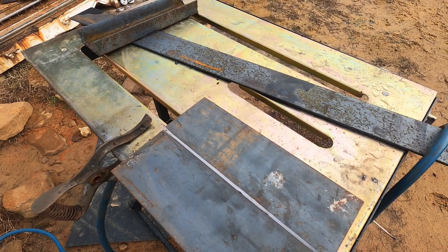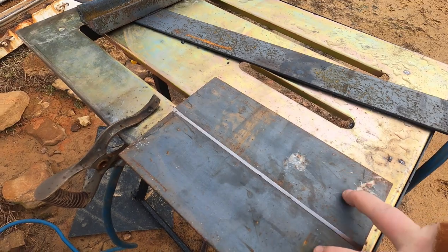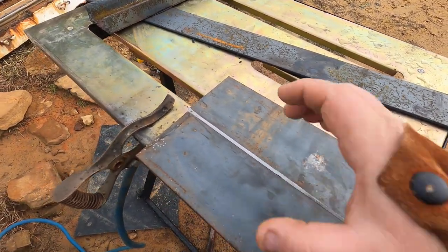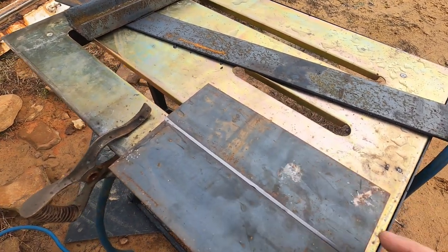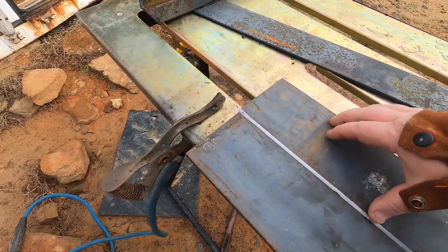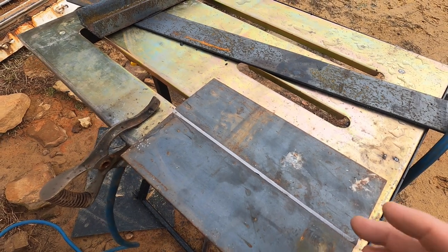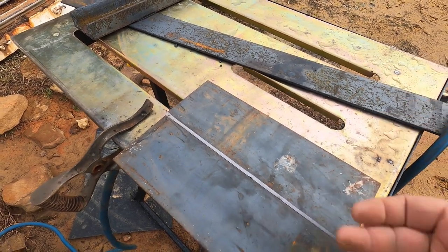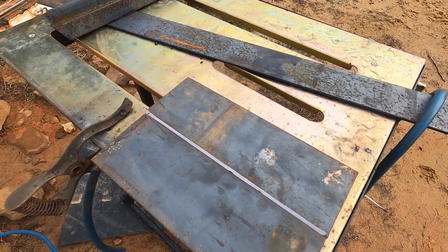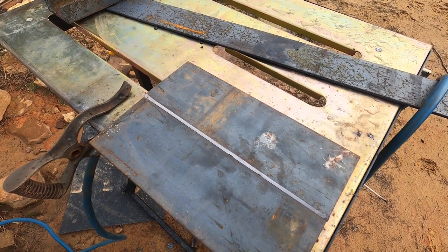Then what we'll do is we'll figure out the hole pattern on the hoist and we'll drill 4 holes so that that can bolt up. And then we'll figure out, based on the holes, where we want the box to go somewhere in there. And then we'll weld this bracket to the box. And then bolt the hoist back to it. And we should be good where we can slide that hoist right onto the fork of the forklift. So back to grinding.